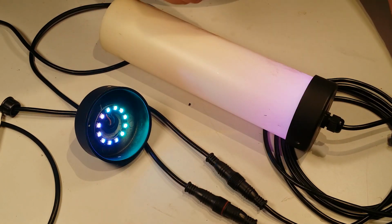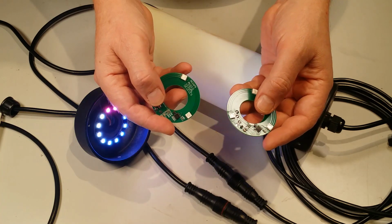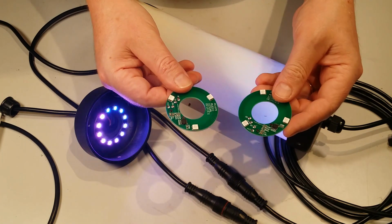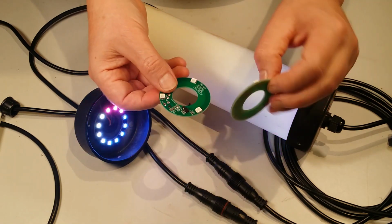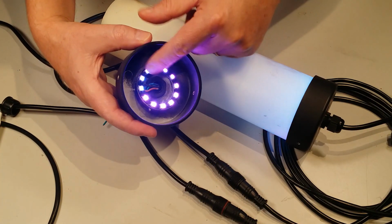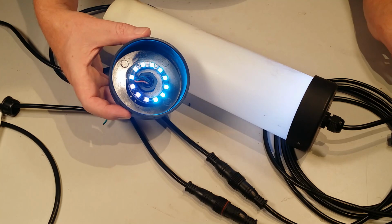In these tubes before, I had just one little module similar to this that I'd made, except they had a little PIC chip on them that did its own patterns. They just did them with power applied, whereas these ones I made as WS2811, data in, data out, a little line driver and everything. Sort of a fairly fancy version of it, but in reality these take time to assemble, and considering the parts cost and the time knocking around, I can just go and buy these pixel rings for about $3 on eBay. They probably cost about $5 in Australia, but buy them from eBay and get them delivered from China. They're only about $3, I think they were.